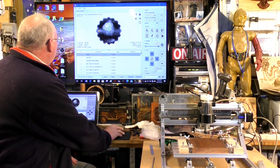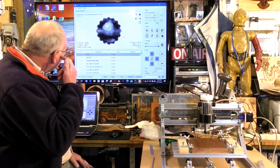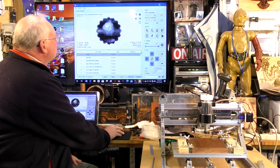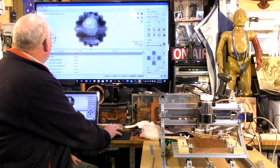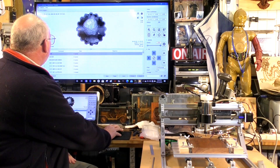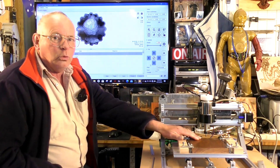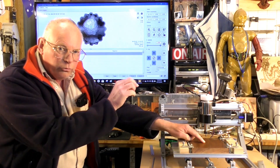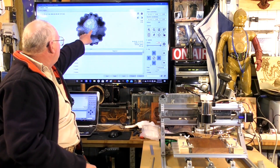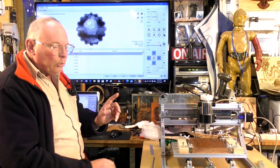There it is — it looks a little messy, just a diagram that shows you what it's doing. I'll make this full screen; you can zoom in and zoom out and you can just about make out the lady's head there. What I'm going to do is position the little router with a sharp tool to the center of the material, where I want the job to start — the origin of the piece of work, indicated by that green dot. It's going to work from the middle outward.